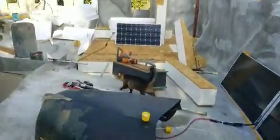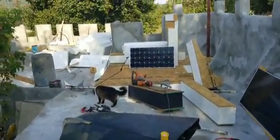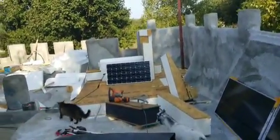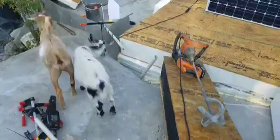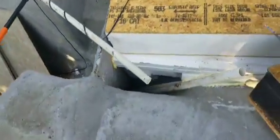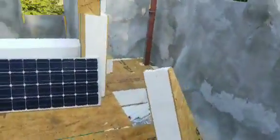And the project this week is extending this insulation plane there this way and then adding some kind of structural ferrocement elements on top. I think today I'm going to be doing aircrete in this corner here because it's packed out with insulation, and last week I plugged the drain down there, so I should be able to put more insulation in there and then pour aircrete in there, and then I can close that up and proceed with this